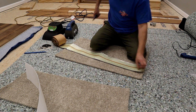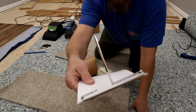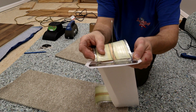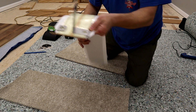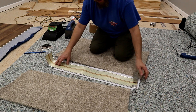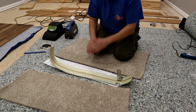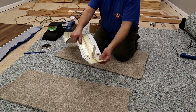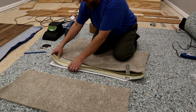Now I want that done. I'm going to take my seam tape, get it measured out to the length of my seam, and cut that off. Right underneath that metal piece is hollow — I'll slide this through to show you. The tape slides right underneath it, and that's exactly what that's for. This Teflon seam board gives you something solid to make your seams on and also keeps your seam tape completely centered underneath your seam.